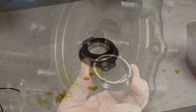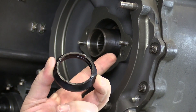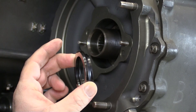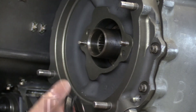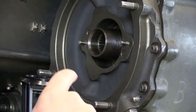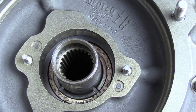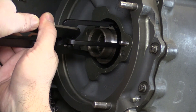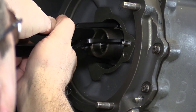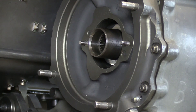On the mating ring, you'll notice these four rotational tabs that are part of the assembly. Inside the drive here, you'll find the four slots that these tabs fit into, so the mating ring is able to rotate with the drive pad of the gearbox. With the mating ring and the installation tool, I'm going to look at the location of the tabs and the slots and deliberately misalign them just a little bit. Press into position, then rotate until I feel that mating ring click — those tabs have engaged in their slots and the mating ring is fully seated.